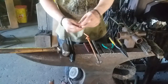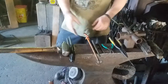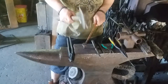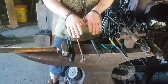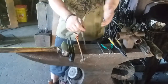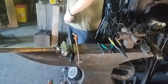I used a chisel — a regular straight chisel — and a center punch, just for decorative purposes, strictly decorative; these are not necessary. One thing I think is necessary is either a ball punch or a ball top tool that you can use with a blacksmith's third hand or hold-fast to make a depression in the steel for the screw holes to mount the thing flush. You don't want screw heads sticking out. There's also a hole punch if you feel like punching the holes, but once you've made the depression you can just drill them — I personally think that's a better option.